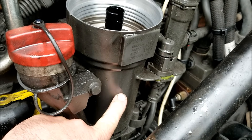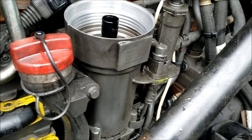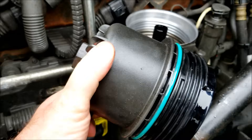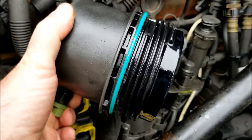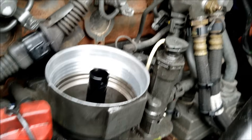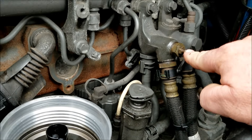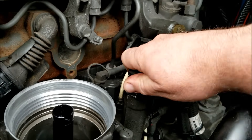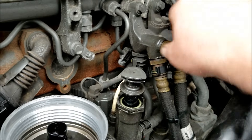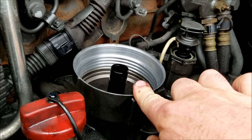We thought maybe the wrong filter got put in, or maybe the O-ring wasn't seated correctly. So we checked it all out — looked at the cap, there were no cracks, the O-ring was in the correct spot. But you can prime it up and it would not run. The primer for these is right here, and you also have a bleeder. This takes an 11mm wrench — you open this up, unscrew it, prime it until fuel comes out, then close it off and prime it up and it'll start. Which it was doing, but within five minutes it would empty the bowl and not fill back up again.